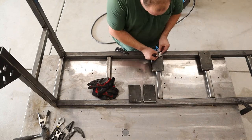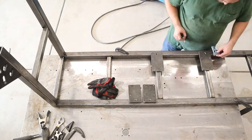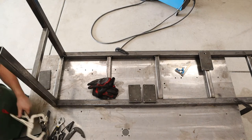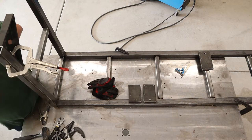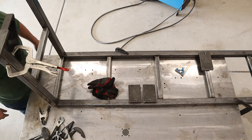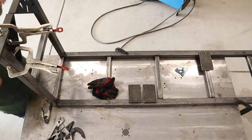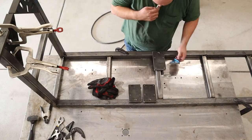The plate that I'm using is half-inch thick and I do like to drill and tap the holes for all the casters. For whatever reason I'm kind of opposed to welding them on — it just makes it so hard to remove in the future if you really wanted to remove the caster, and welding the caster to plate also just heats up all the grease and bearings. So I've usually been pretty opposed to welding casters on and usually go through the effort of bolting them on just for ease of removal.